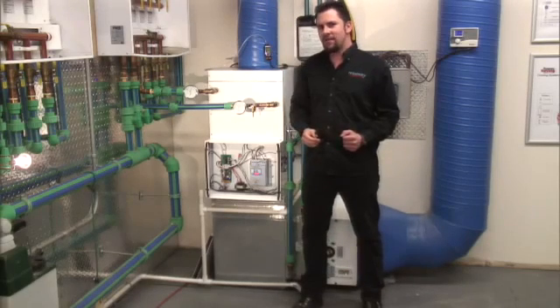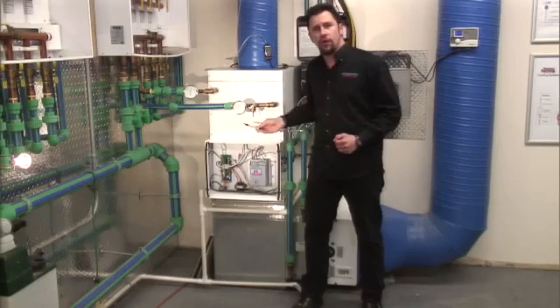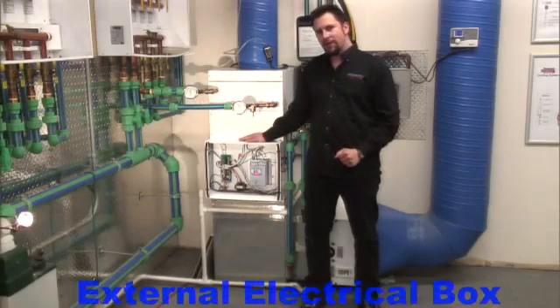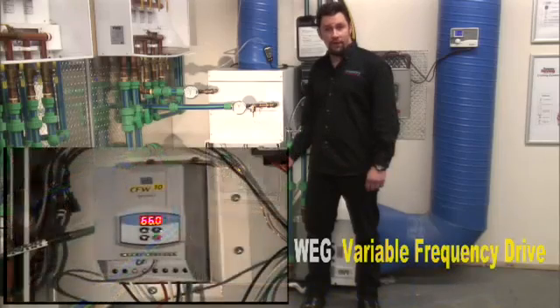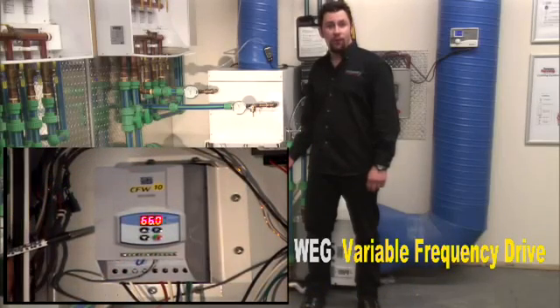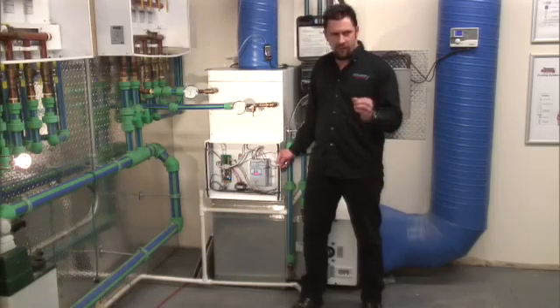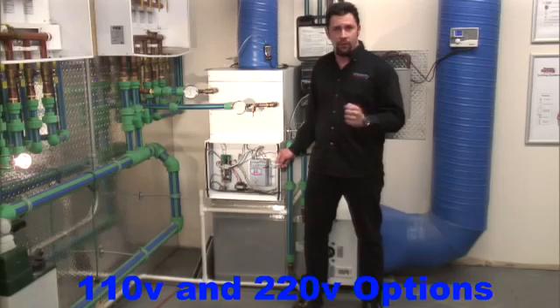With the new HE Z series fan, this pressure sensor will be mounted internally within the fan cabinet requiring no in-field installation. All of our new fan coils will feature the external electrical box which is taking all of the circuitry out of the airstream. All of our new systems are going to feature the WEG variable frequency drive. This is proven to be an extremely robust product which we are very proud to offer in our systems. The WEG controller is voltage specific to 110 or 220 volts and both will be available as an option.